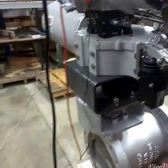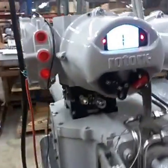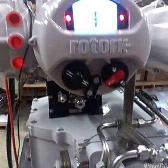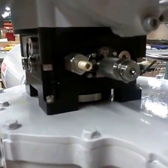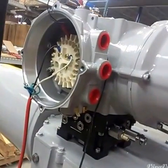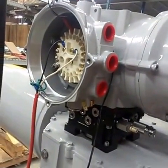This is just a functions video. Right now the actuator and valve are closed. We're in local control. We've got our hydraulic manifold assembly set to auto, not manual. And we have our ESD or emergency shutdown voltage supplied to the correct terminals and supply voltage to the actuator.